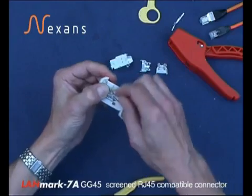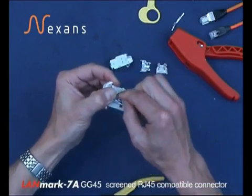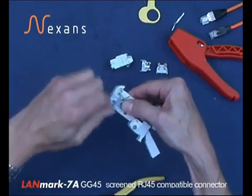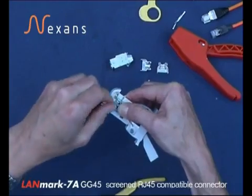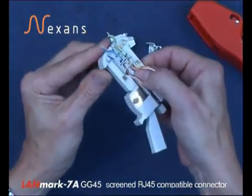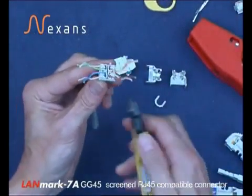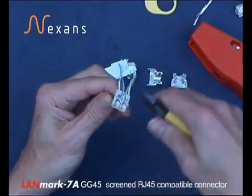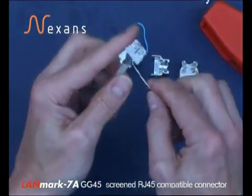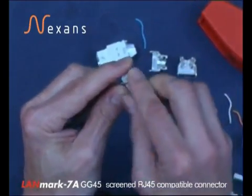In the case of a CAT7 termination, solid brown is to the outside of the two slots. All the other colours are to the centre. Open the tool up, slide it off, cut off the cores and take the braid over onto the strip there.